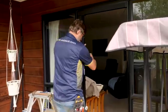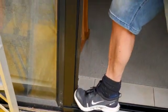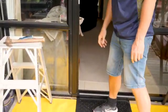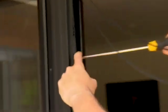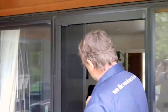And this is now where I click my cartridge into place. So what I normally do is I put my foot into the bottom, and I push bottom first, and then I push it all the way in until you get like a seat belt where you get that nice click going along, and that's now in place. Now you see that I've got a lot of strings hanging down here. Now that's because I've cut 150 mils off the screen. So before I use the screen, whilst it's in place, I'll take up the tension of that by loosening this, giving it a reasonable bit of tension. Now we've got a screen that we can test.